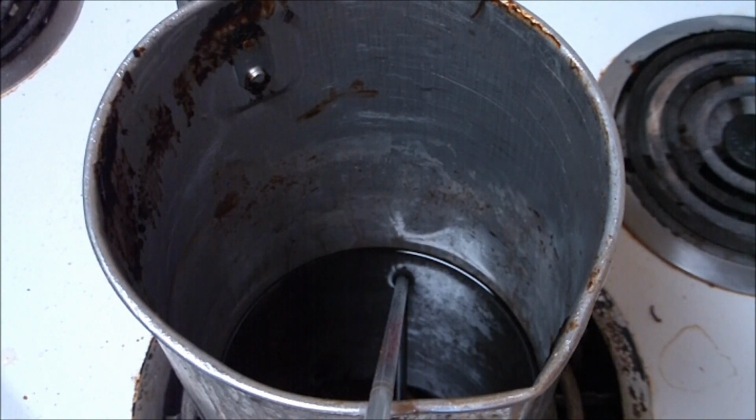So what you see here is known as brown wax that we are heating up. This is original Edison brown wax dating from around 1898 to 1900. Some collectors sent me some broken cylinders that were smashed beyond usability. So I have remelted them down, added 1% bovine-based stearic acid to freshen up the wax, and we are going to recast a new blank out of it. So we have to wait until the mold is ready. We heat the mold for 1 hour at 300 degrees Fahrenheit.